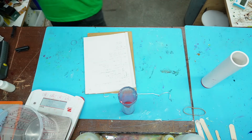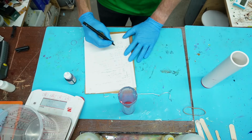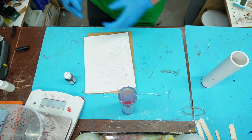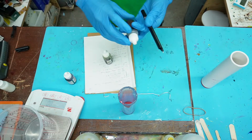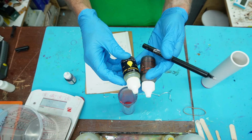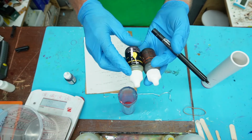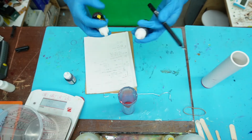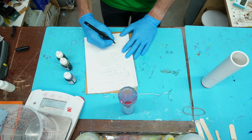And purple is another one that's super dark. Okay, the violet dye from Alumilite. So we're going with a pinprick of that. The gold, orange can take over. If you're just trying to make yellow a little bit more orange, the orange one is super concentrated. So I'm gonna put a drop or two of the translucent yellow, and then use a tiny pinprick of orange to bring it into a little bit more of a goldish color.